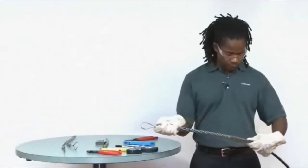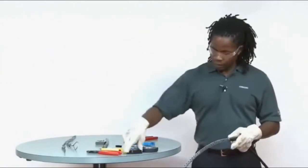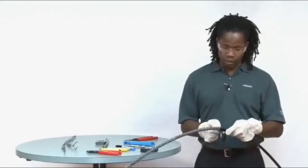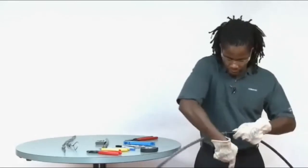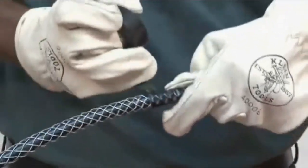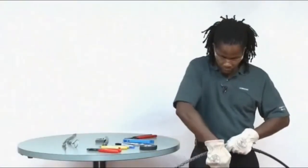Smooth the mesh over the cable and give it a small tug to make sure everything is snug. Then we're going to apply electrician's tape starting at a point one inch from the end of the mesh. We have to wrap the tape really tightly to make sure that the mesh is fully compressed against the cable. A good measure of how tight the tape is being applied is to be able to see the imprint of the wire mesh through the tape. Occasionally give the cable a pull just to make sure everything is still tight and continue wrapping. We are now ready to connect the cable to the pulling rope or pulling tape.